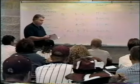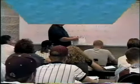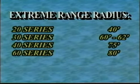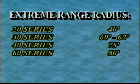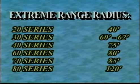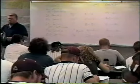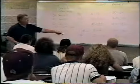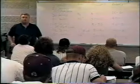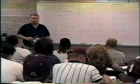The 40 series, we're up to about 75 feet. The 60 and 70 series, somewhere around 80 and 85. And the 80 series, as much as about 120 feet. You can see when you put a lot of water with a lot of pressure, you can throw it a long ways. 120 foot radius. That's half the length of this building.